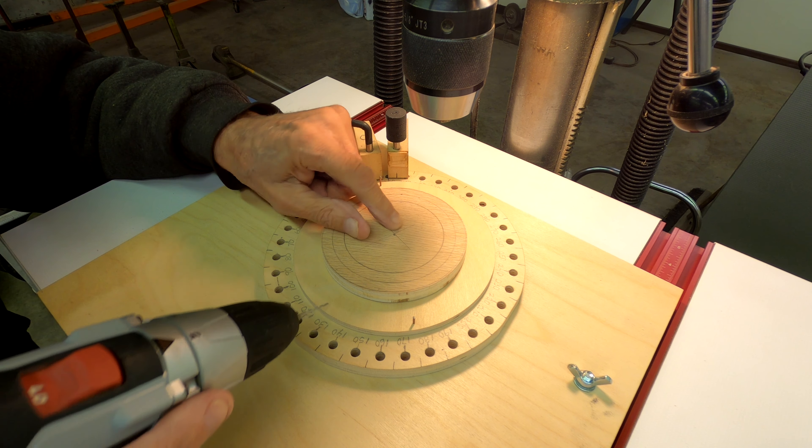Now we've got to move the drill base over and get it on my line — about right there. I'll fasten this down to the drill press table. I'll start at zero; I have marks along the side every 10 degrees. This first pin is for 10-degree increments and this one is for 5. We'll start at zero and put the pin down until that locks everything in place.